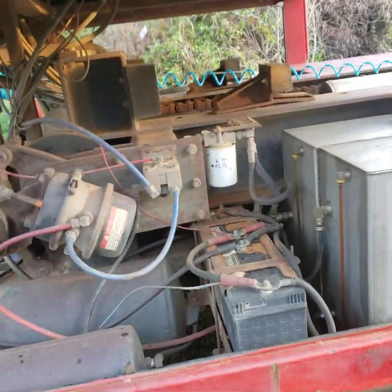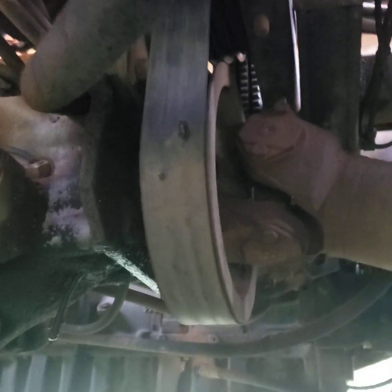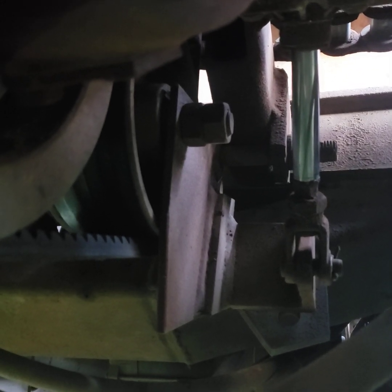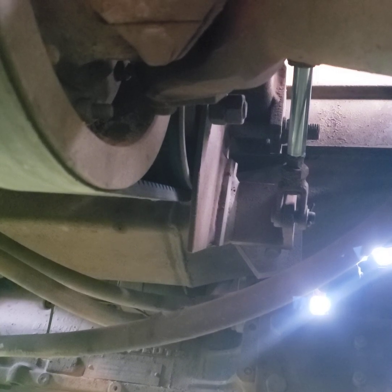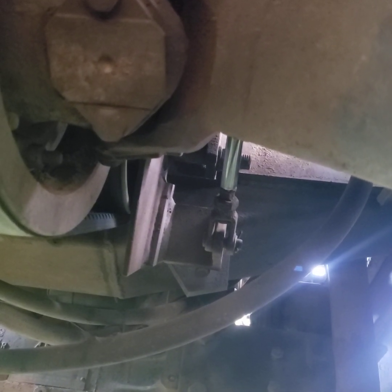Going around one more time on the box belt — all the drive line is from that front axle back. There's no drive shafts or nothing that go to the front of the sled. The box belt is that 3V belt on that pulley up top, connected pretty much on the tail shaft, output shaft of the Allison, because there's that short drive shaft that goes to that back rear end. All this belt's purpose is to run the box. There's the air cylinder that activates that tensioner pulley, and it's sitting here with pressure on it right now from where I ran the box out. In some of the cab videos people ask — I'll flip that little yellow and red PTO valve on the console. What I'm doing before I stop is putting air to that air cylinder to give it a second for the air to put pressure on that pulley so the belt's tight, so as soon as we stop I can jerk it in gear and won't slip the belt.